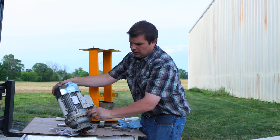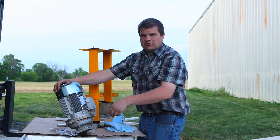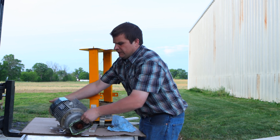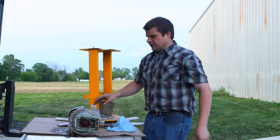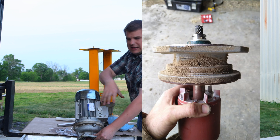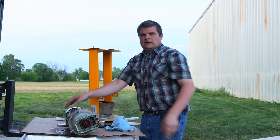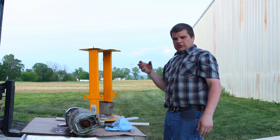This particular joint you can hardly separate. You can take the bolts out and rotate it, but these two shafts are seriously stuck together. So the best approach is: pull the cap off, take the rods out, and just lift the shell of the motor right off. Then we moved the shell from the bad motor over to the good gearbox.